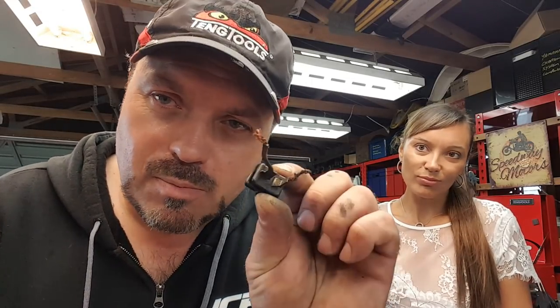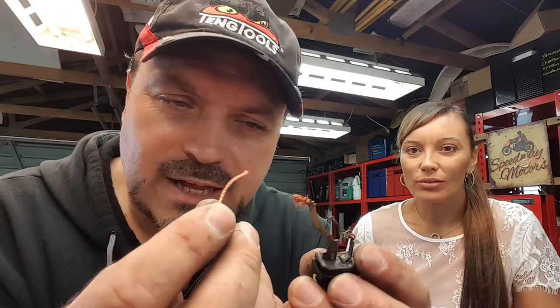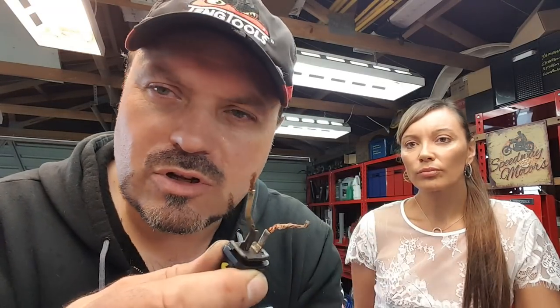So we've got the little brush connector here, and we've got the brushes in the bag, and we're going to have to solder on what we call the tail of the brush, all technical terms, isn't it? I'm by no means an electric motor specialist at all, but I do usually bumble my way through. We've got the new brush there, and these were, as you know, very expensive, so I'm going to drop it on the bench. We've got to solder that tail onto the actual brass arm, and they're different lengths because this thing's offset to the brush holder. But I think because we'll just solder them onto the existing wire, we'll cut that one down a bit, and we'll solder them onto those. Fingers crossed. It's going to work.